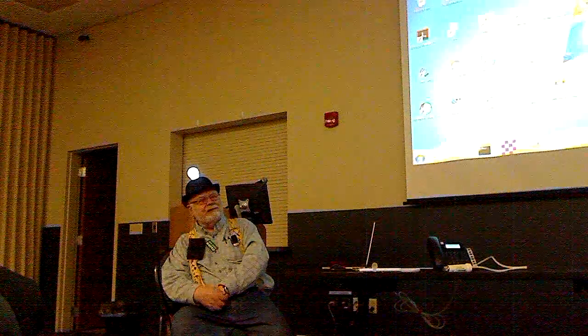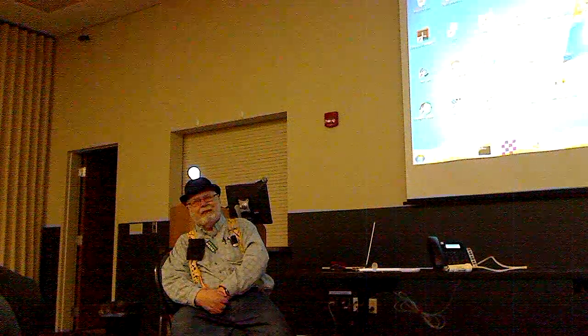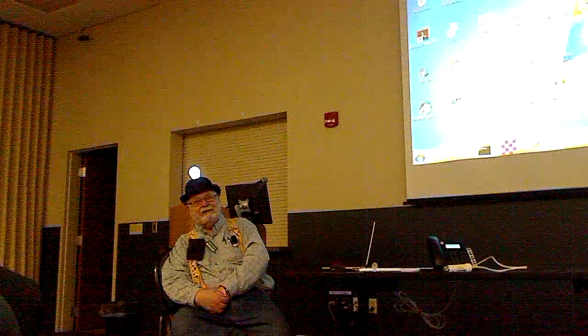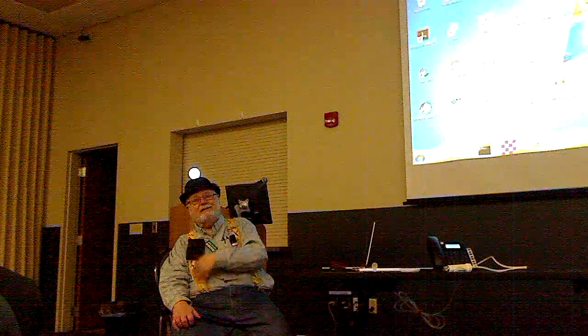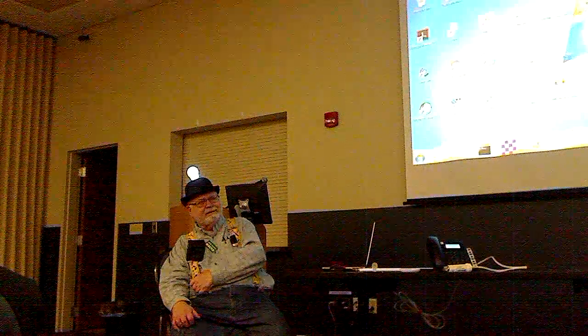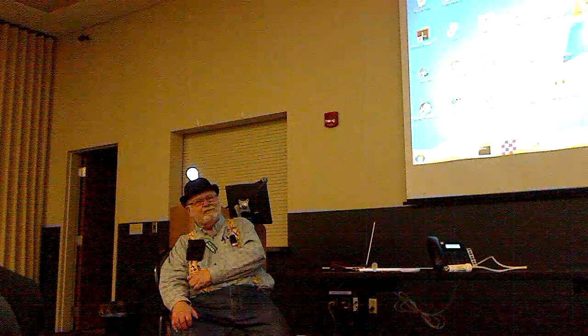I talked to people in Madison County last month about connecting — that would be great. Q: 'Do your Delaware mesh nodes have internet access?' No, but it's not difficult to do — many mesh nodes around the country have internet access. The AREDN software makes that possible. One mesh node needs to have internet access, and then they all do, but you need to control it with passwords. Speed would be reduced depending on how many nodes are connected simultaneously.